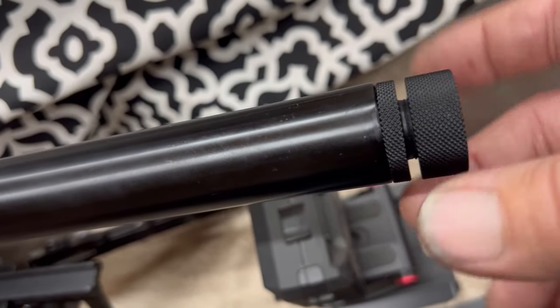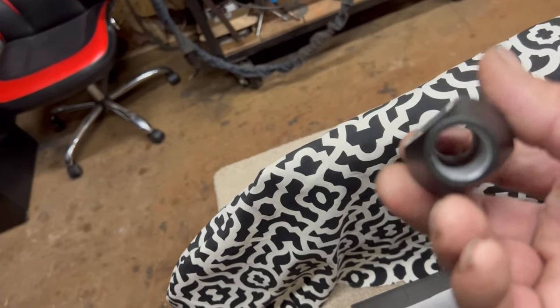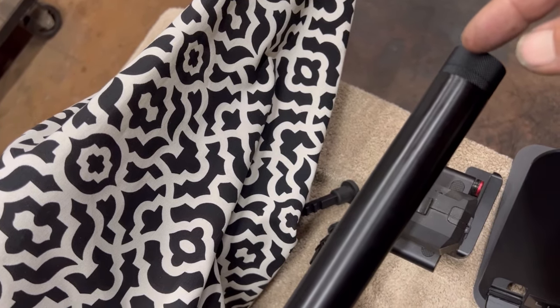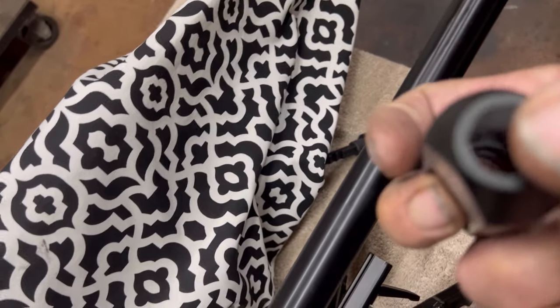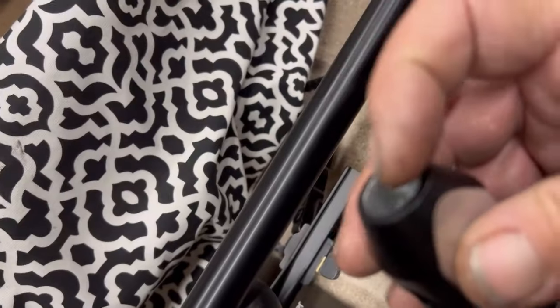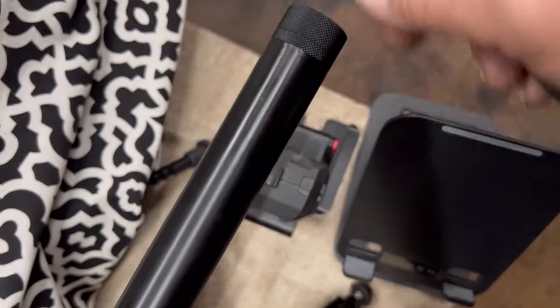I did get an adapter — I could run a Donny FL on here but I'm not doing that right now. This mount here I sanded down and gave it a nice finish, then bored out the inside to 15 millimeters. The mount is 18 millimeter diameter, but I'll bore it out to 17 millimeters. I've got a 17 millimeter drill bit coming, as well as an 18 millimeter tap so the thread matches.